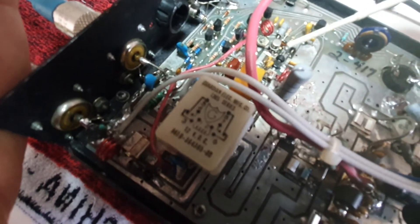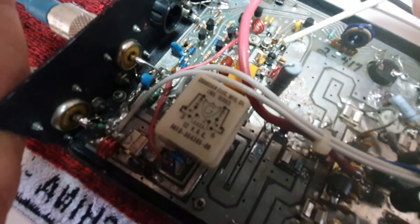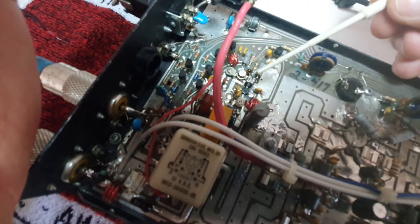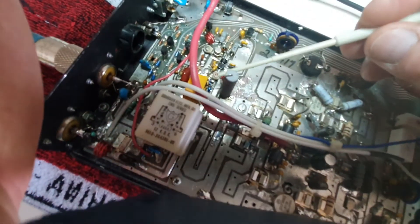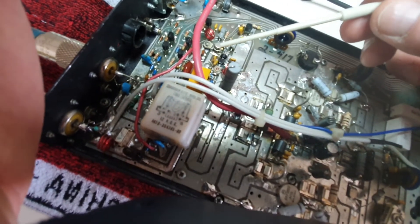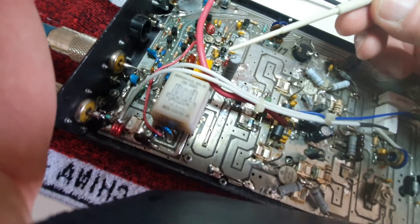Also in the process: I ordered a U309 JFET, which is the second amplifier stage — it wasn't present in this particular amplifier. Then we have the CF300, which I'm replacing with an MRF966 — that has also failed. So we now have this amplifier back in, and it's switching through this relay here on transmit for the preamp stage. Hopefully it's just this amplifier that we need to replace now.